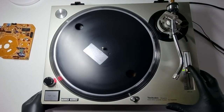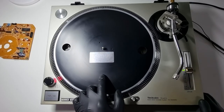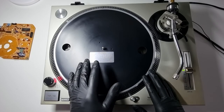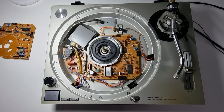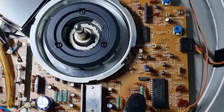We've got a working turntable. So, as you can see, a simple break in a board on a component that costs next to nothing can cause this problem. Now, I'm not saying that there are no other issues on the board, because if I take this off again and show you the comparison between the two boards, it's quite apparent with the heat on that particular corner here.